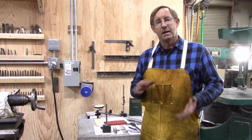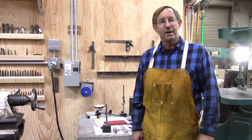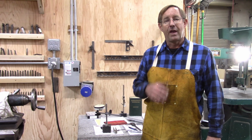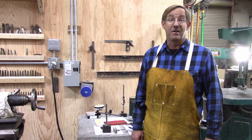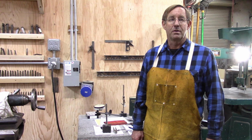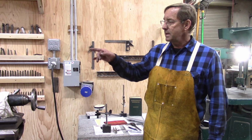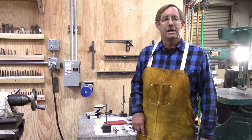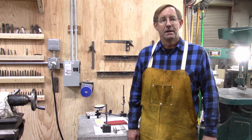It put an inappropriate wear on that wheel, so more than likely I'm going to have to take that down, and I might even try turning it on the lathe here and flatten it out so the wheel's flat again. From one side to the other, it's probably a half an inch off, so that's quite a bit. The wheel's only about 8 inches wide or so. So when I pull it off and put the new bearing on, I might see if I can put it on the lathe and spin it and get that wheel flat again across the top.